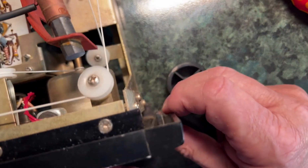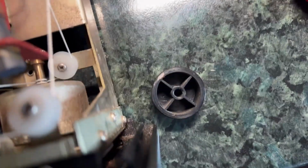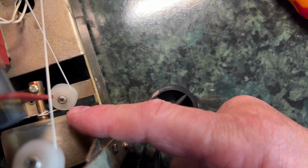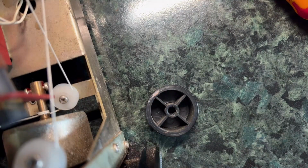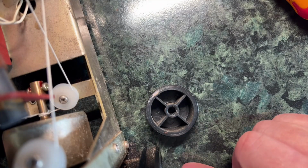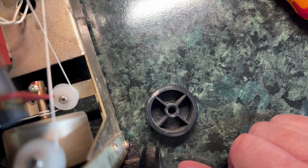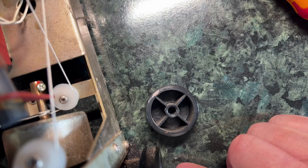When I look at the flywheel thing, it seems that it goes round. But what I can also see, if you look at the way it's wound round the back of that flywheel, you can see it sort of winds back on itself. It's not a straightforward wind. There's a little bit of a fray in the cord, and when it gets to the point where it doubles back on itself, it stops going round. Now, how has it got like that? Did somebody wind it on like that? I doubt that. I mean, they'd surely have known it was wrong if they rewound it like that. Did the drop cause it to just disengage somehow, or is the fact that it's slightly off centre cause it to disengage? And if that's the case, can I actually flip that back into place and get it to run round properly without having to take the whole cord off?